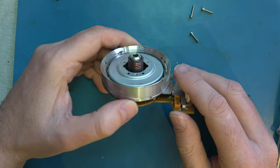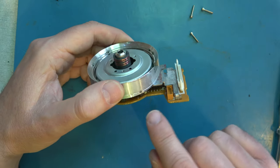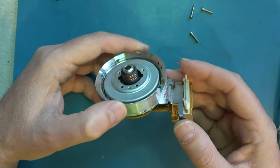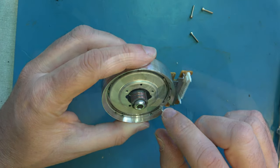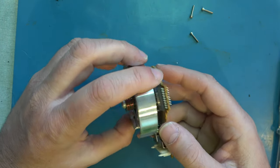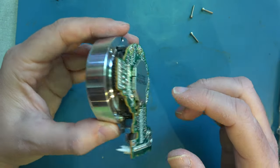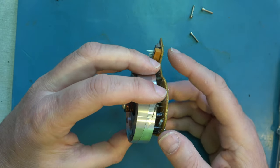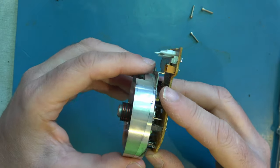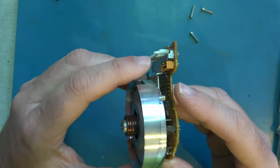So it could be just an open circuit, or it could be there's some electronics in here. Now, of course, some of the electronics in the bottom here are concerned with the drum motor. So here we have this big IC here. That's a power IC. That's clearly concerned with the motor drive. But some of this may be concerned with pickup from the video heads. Or they may just be connections. Can we work it out?